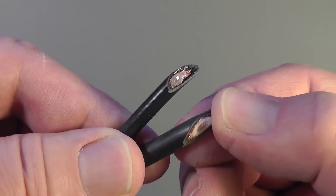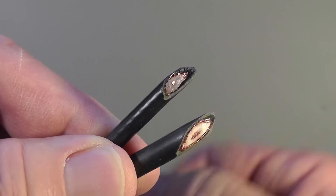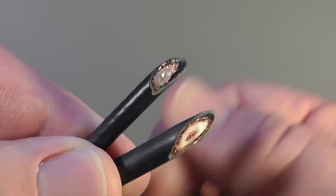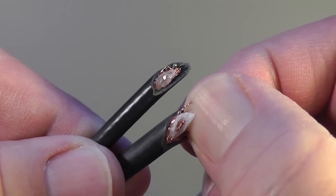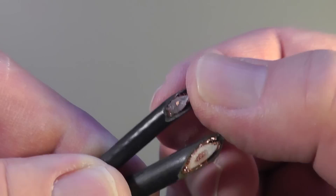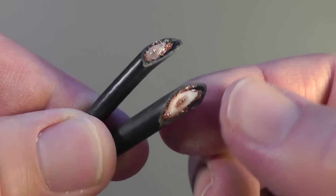In general, there are two types of coax dielectric. The old kind is a solid plastic, as seen here in this sample of RG58. The center conductor in these will migrate slowly. Many newer coax types have a foam dielectric, such as this RG8X equivalent. These allow the center conductor to migrate more quickly.